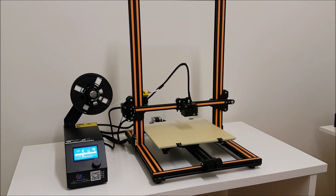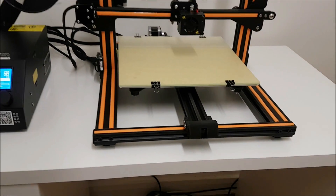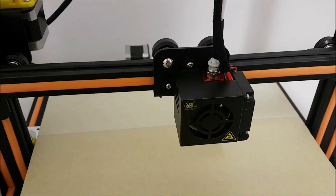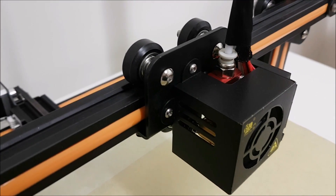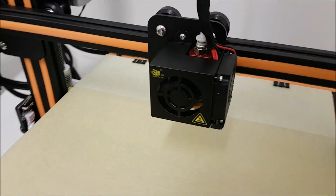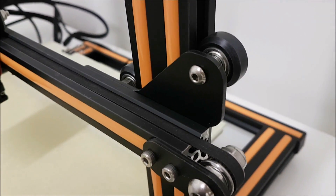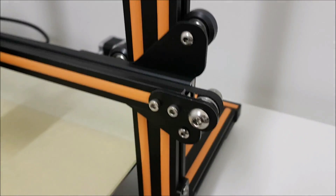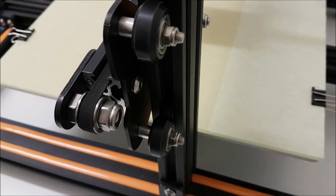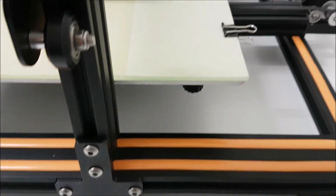Let's talk about build quality. This printer has a full metal frame which is very heavy and strong — industrially designed. It uses a totally different technology for movement: there are no linear bearings on this printer, they are all roller bearings, which are more stable, stronger, and can last a very long time because there is no friction — it's just rolling. I think these rollers will last practically forever, and they are totally silent. The only noise from this printer is from the fan inside the power supply.